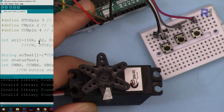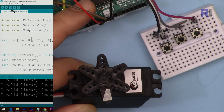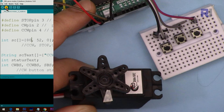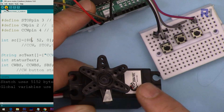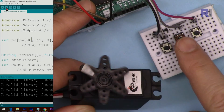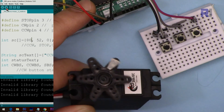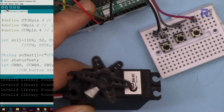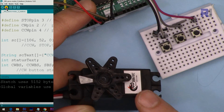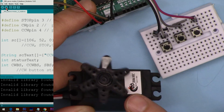You can play with these numbers to increase or decrease the speed. For the counterclockwise direction, if I change the value to 80 and upload, then pressing right gives maximum speed and pressing stop works. The motor moves a little slower now compared to the previous value of 106. If I upload 106 again, you can see it moves faster — so values like 0, 80, and 106 control speed and direction.